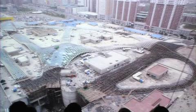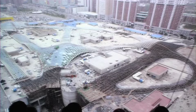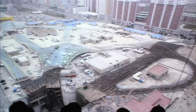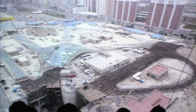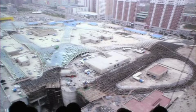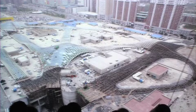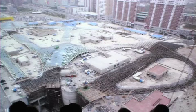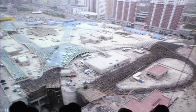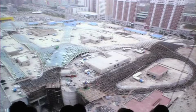I mean, the geometry is not easy, it's sort of getting all that sorted out. And the funny thing is, like here in this part, there was absolutely no coordination. I mean, that's the biggest issue in China, that the concrete guys do their stuff and the steel guys do their stuff, and the architect doesn't care. And nobody has actually looked at where the two bits come together. And so, down here, we'd already sorted out that the steel went below the concrete. And we said, well, where does the water go? Inside building. No, not inside building. So you get areas like this. We said, even that we thought we'd sorted out, but no, you still had an area that was low. So we said, this won't do. He said, no problem. He comes in, gets his guys, cuts it all out, lifts it up, turns it around, and rebuilds it. Just not a problem. Quite extraordinary, really.